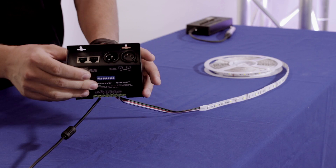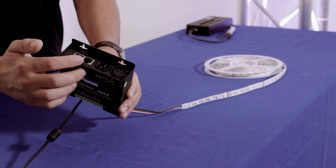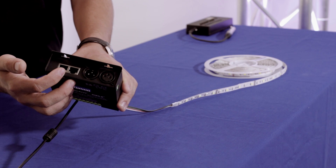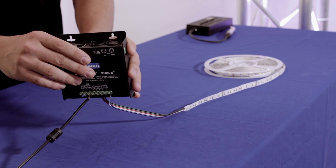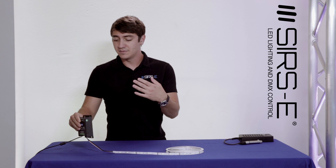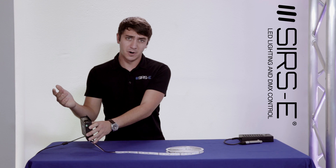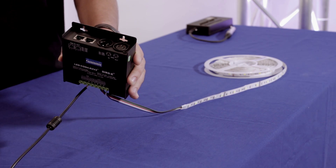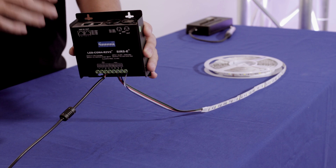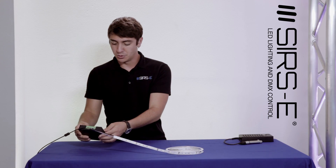On this version we also included XLR DMX in and outs as well as RJ45 in and outs. This is a benefit whenever you have different types of cabling — it gives you more options so you don't have to go buy adapters to go from RJ45 to XLR. And if you're just used to running RJ45 to RJ45 from controller to controller, those are here too.